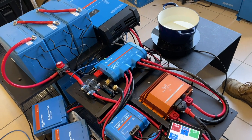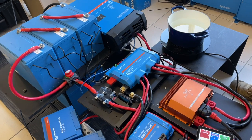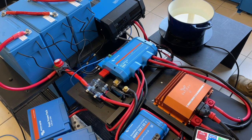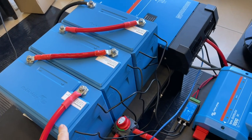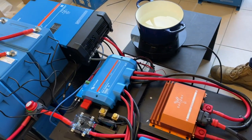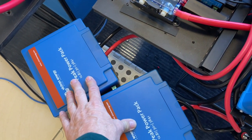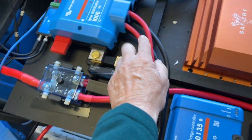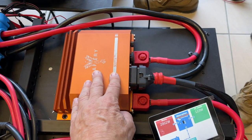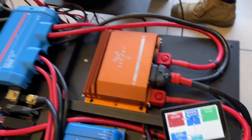Hi, Bruce from Safari. We're looking at a power system for a centre console fishing boat for Shane Griffin of Serena. This boat is quite unique — this power system is very unique. We've got 36 volts for the Minn Kota up front, and there are no other house batteries on this boat. These two power packs down here are simulating two alternators, putting power into our 12 volt distribution bus. We're then going through Scotty here from 12 volt to 36 volt and charging the 36 volt battery bank.